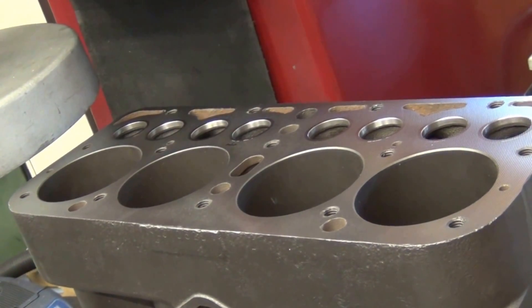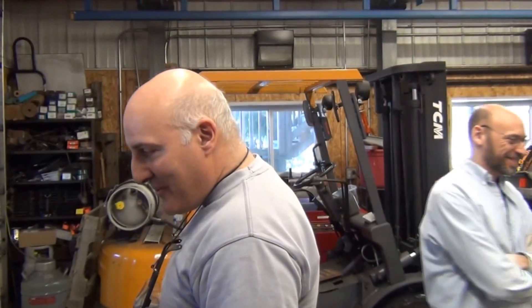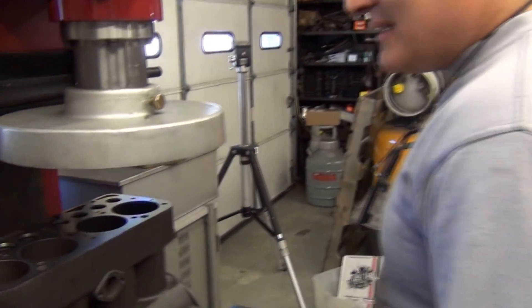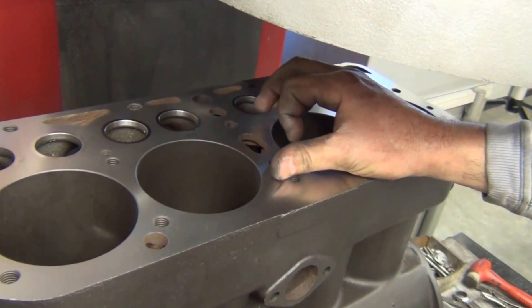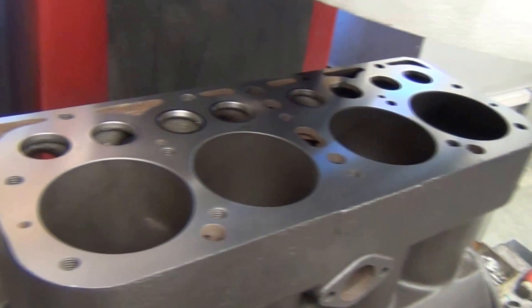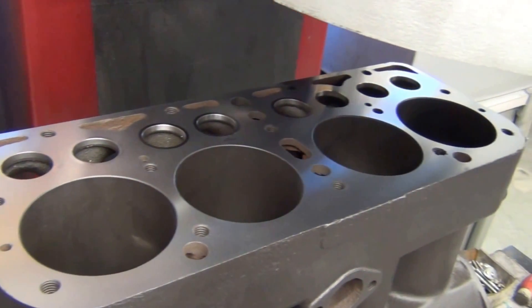We're going to change out that bit again to cut the rust out of it. We've removed a final total of nine thousandths off of Seth's block, and you can see from what it was to what it is now — it's like my proverbial thumb test. You can see the reflection of my finger in the cast iron finish. This is good to go now for the surface.